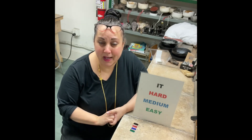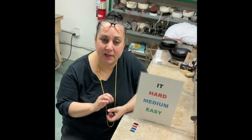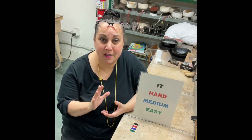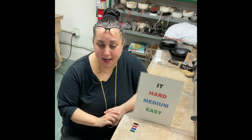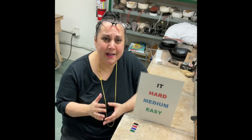They add more zinc to easy solder, and zinc causes issues — you'll notice that when easy melts, it looks a little more yellowy, so the color is not so great. Because of the additional zinc, it's not super controllable. It's not that it's hard to melt, but getting it to melt where you want it and go where you want it to go is difficult. I almost never use easy — I always find another way around. Medium is usually a better choice, so keep that in mind when making your decisions.